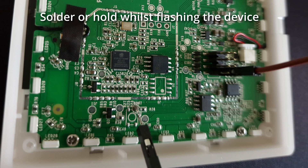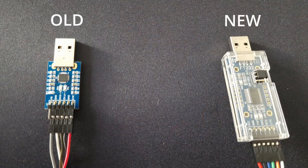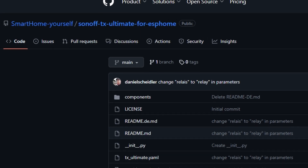You'll need to solder a wire from the boot pin to one of the other ground pins. I used esptool to flash the firmware. I had some issues at first — it seemed to be because I had a really old FTDI adapter and was struggling to get it into bootloader mode. I bought a new FTDI adapter and as soon as I did that, it worked first time.